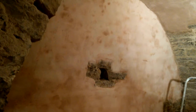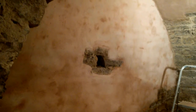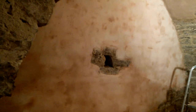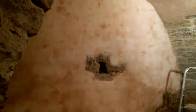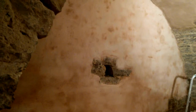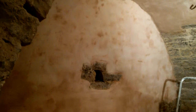That's using the lime-based plaster with the kind of ground-up tiles. It looks more pinky but it's meant to be a reddish brown. It dried a little bit patchy because the underlying surface was quite mixed — there were bits of mortar, clay, and all sorts of stuff. I did brush it off so there's a good keyed surface, but I've noticed this with repointing as well in other places.